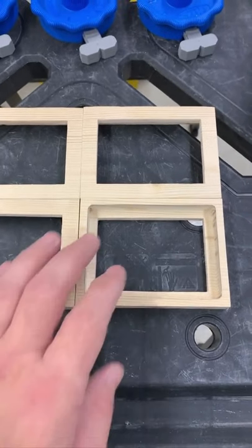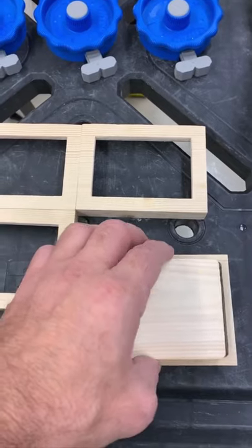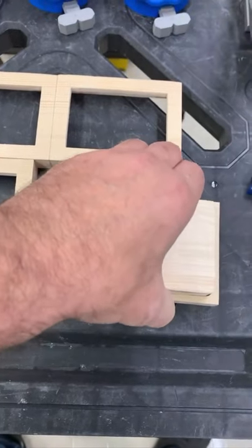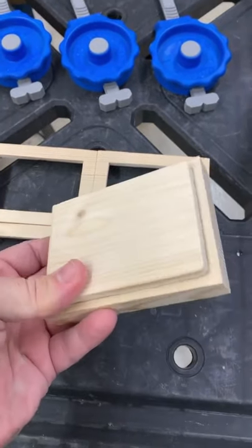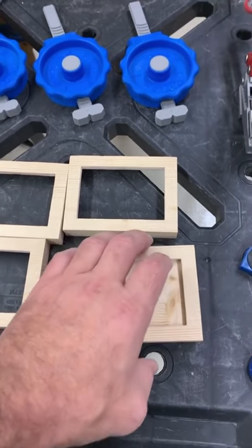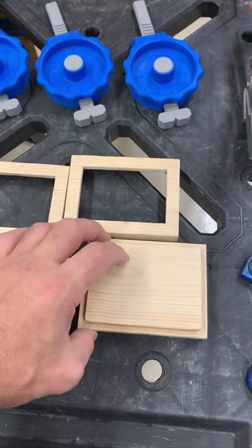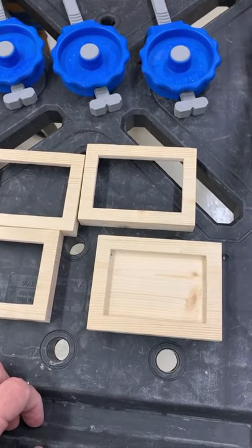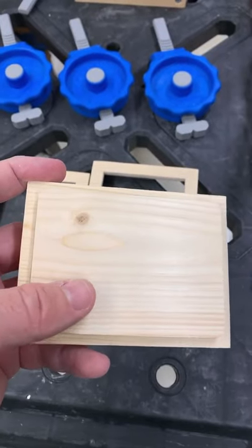Back to frames. The next phase is: once I have this routed-out frame, I create a backing plate. That backing plate fits exactly in the frame — it's a press fit. The plexiglass and the artwork and matting and the back plate all go together. Then I trim off the excess, cut a hanger hole, stain the frame, and then the frame is done. And I typically add my wood burned logo to it. So there are still a lot of steps left to go.